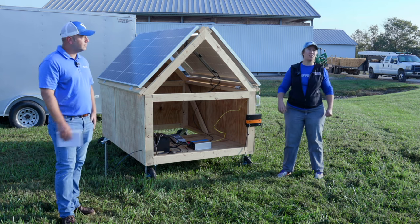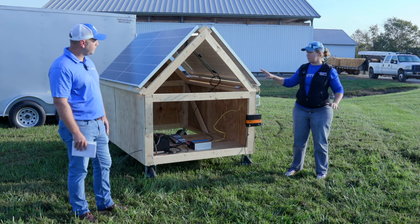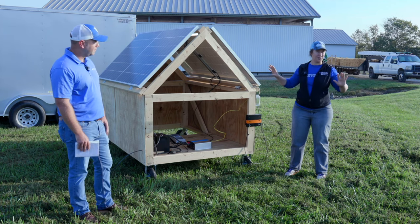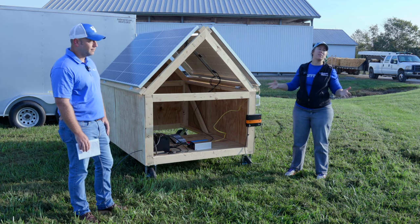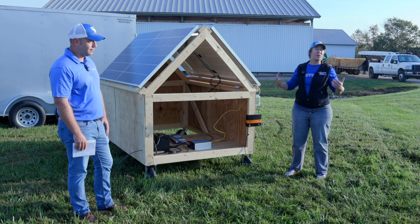The question is: does the wiring cause you to lose power? It depends a little bit on the size wire you use. You're always going to have a little bit of resistance on your lines, but if you undersize your wire, that's where you run into some real issues. You want to be careful not to undersize the wire.